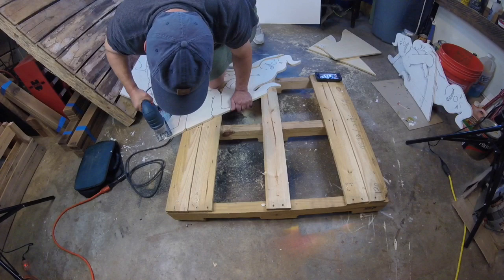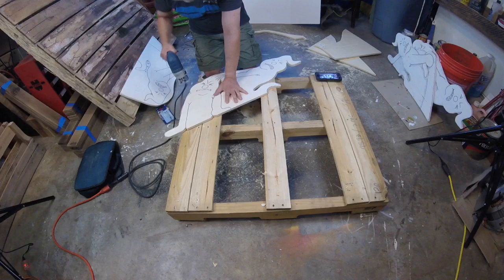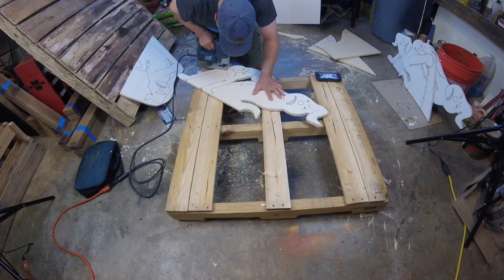I found when going around curves, if you slow down a little bit it's a lot easier. Reducing the speed of the saw when going around curves makes it a lot easier. This is a variable speed saw so when you pull the trigger it goes faster, when you let off it slows down. That's important — it gives you a lot of control.